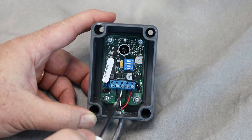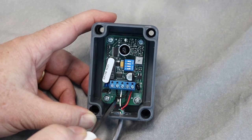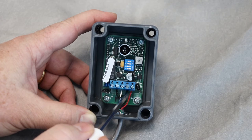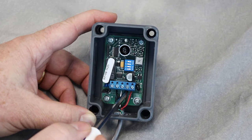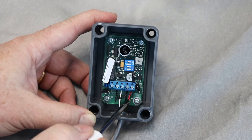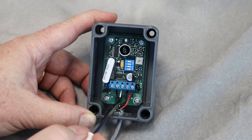I have a black wire here which is the common wire. It goes to the signal common and then over here to the power common. They're tied together here in the transmitter section of the PhotoEye, and then the black wire runs over to the gate operator. The red wire is power and the white wire goes to the normally open terminal.